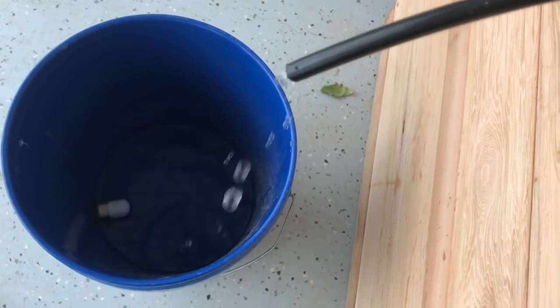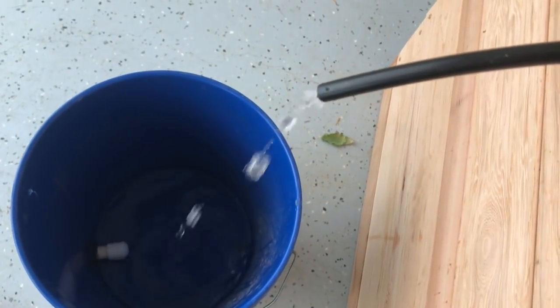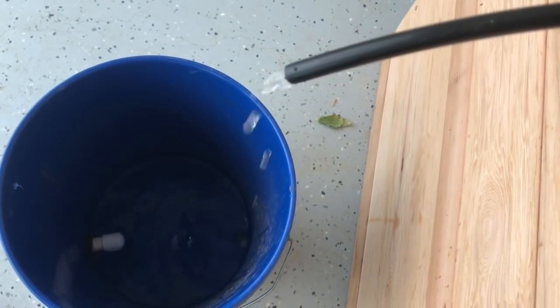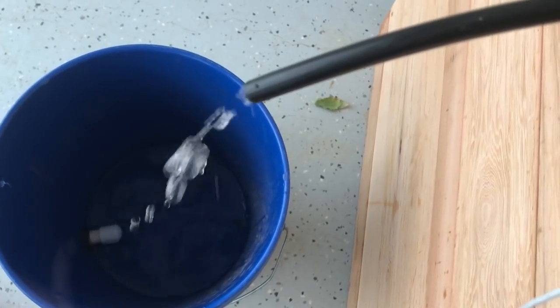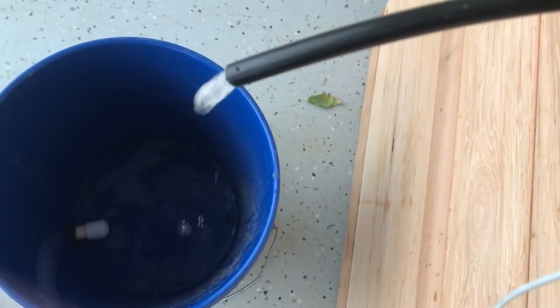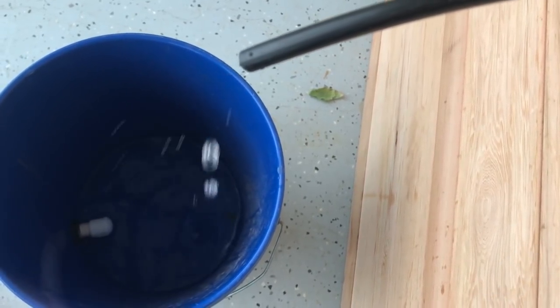This is the output of the pump in about 13 inches of water. As described, this pump uses a three-quarter inch PVC pipe inside a one-and-an-eighth inch housing, and it is really, really working well.